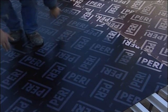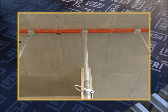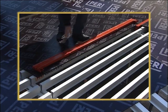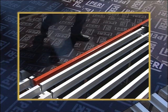For shortening the stripping time, GRIDFLEX beams are installed and then supported before striking itself takes place. While the concrete is still hardening, the formwork is available for the next cycle. During shuttering, the beams are simply laid between the plywood at the predetermined support axes. Ready.